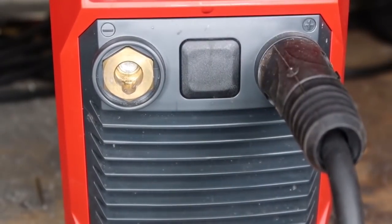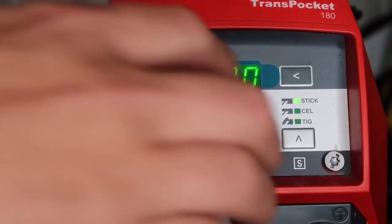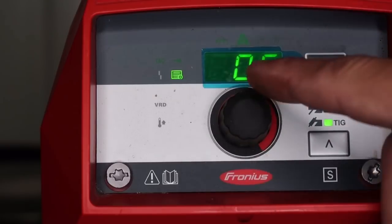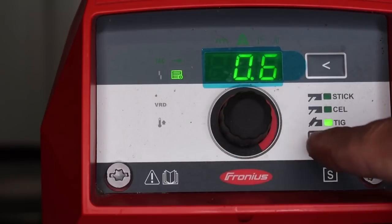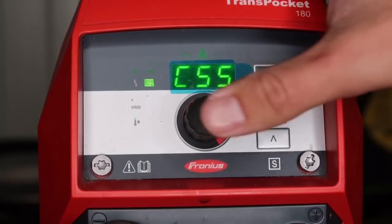Time for TIG welding. Make sure your ground cable is on positive and plug your TIG torch into minus. I have a check valve on this TIG torch for the argon gas. I'm bumping down to TIG mode and going into the background menu. I'll set my TIG comfort stop setting to 0.6 volts, push the black button in, hit the bottom right cursor, and go to the main menu. I'm striking an arc, moving along, I pull back — the amperage drops out. When the machine senses that voltage change of 0.6 volts and you pull back on the torch, the amperage ramps from 70 amps all the way down to nothing.